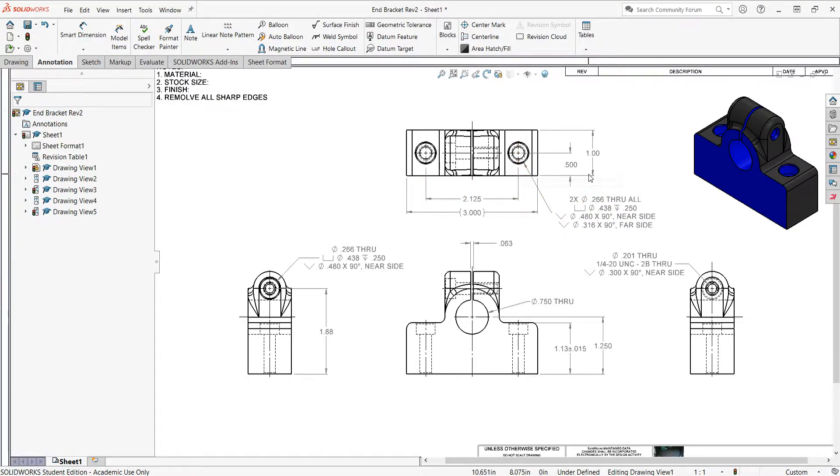I have the one inch size for this part thickness. The three inches is a reference dimension, and hence it's in brackets. It doesn't get machined, but it's sometimes nice to add a few reference dimensions just for them to check and make sure that the casting they receive is correct.